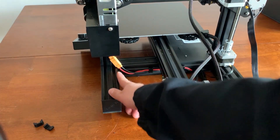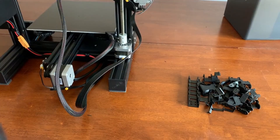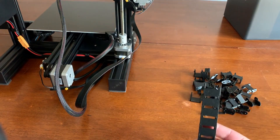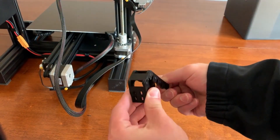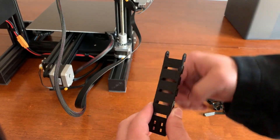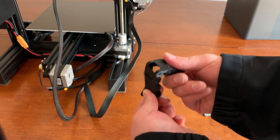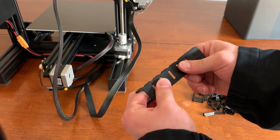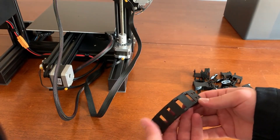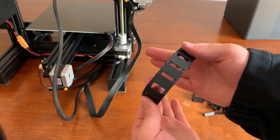This block here makes it a little bit tougher to get that cord in a really clean place, but it is definitely out of the way of any moving parts now. This final upgrade is probably the one that I'm most excited about. This is going to form a cable chain which is going to be able to move freely with the wires but also protect them from the outside and keep them in a straight channel. I have to do a lot of pre-working on these parts just a little bit to make sure they move freely. What you don't want is for them to get stuck with the wires in there, because that's just going to add stress points somewhere else in the wire. Make sure you spend the time to ensure these move freely before you install it on your printer.